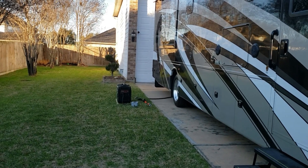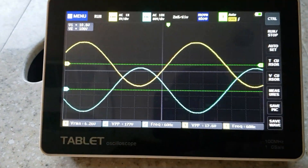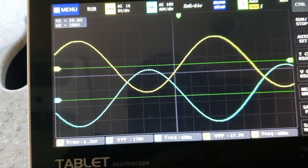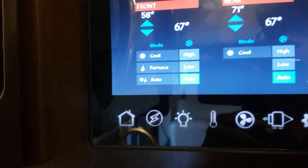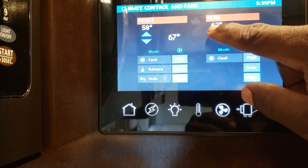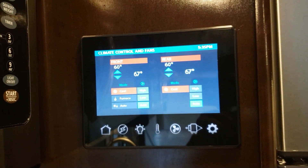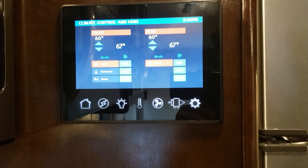Let's go ahead and get inside, turn on both ACs and see what we get at 50 percent. We're getting a pure sine wave — no distortion. First thing I did is turn on the refrigerator, got all the lights on, and we're going to turn both ACs on, then do a dB test at about 50 percent.